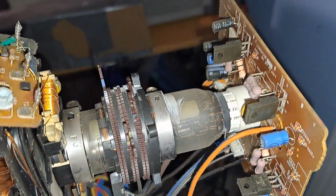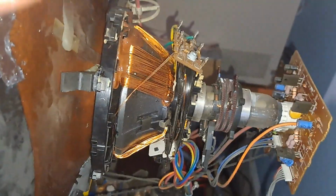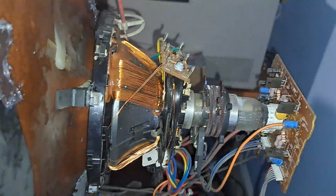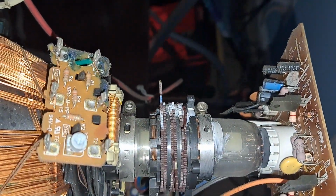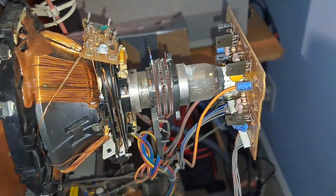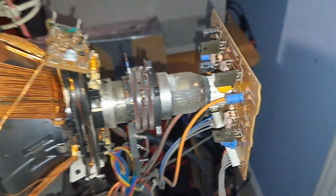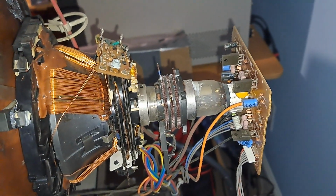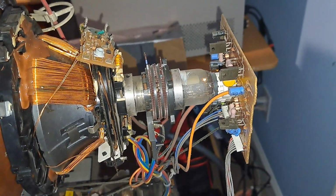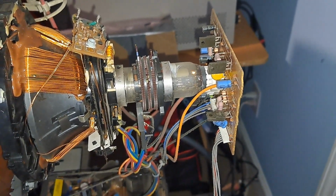So, back here you see the little nubs that stick out right here. This is actually a tensioner, and you take the whole thing and just turn it that way to loosen it up, and that will loosen all these rings. Now, as you can also see, there was some adhesive on these rings, but there's no longer adhesive stuck to it because I moved them. There will sometimes be a tensioner like that, depending on the TV or the video monitor that you get. But sometimes they don't have that, and usually how they keep them tight is they glue them together. So just be aware of that if you're doing an adjustment on your own.